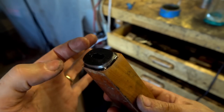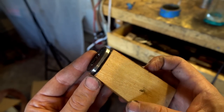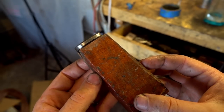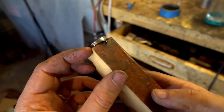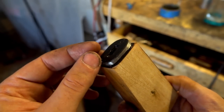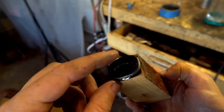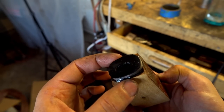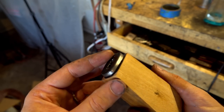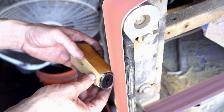Normally, most people would drill a couple of pinholes on either side of the tang hole area through the guard, the handle material, and any other spacer materials, such that the pins can be used to hold them all together in a constant orientation while shaping is going on. I've tried that several times now with minimal success — it has a lot of benefits, but I just have not had much luck with my drill press getting holes that are very tight and hold everything together in a constant way.